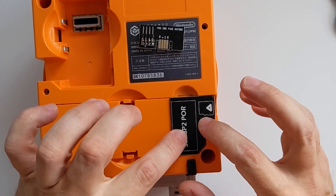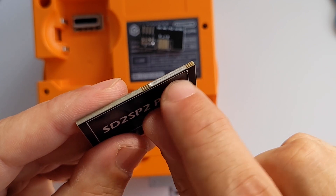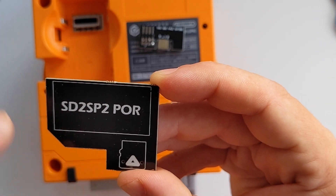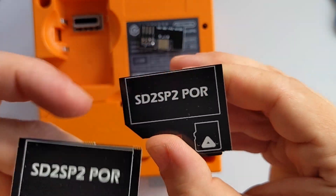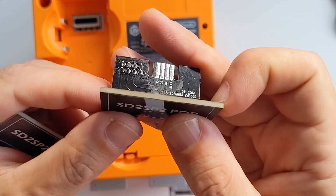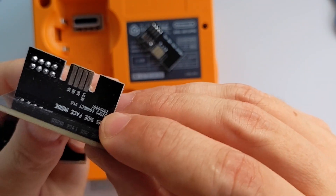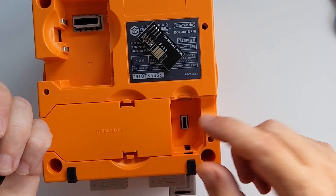The first modification is to get this part to fit neatly in place, and that is simply an issue with the PCB itself. You can see there are these zigzag edges where it's clearly been part of a large assembly — they've just been snapped apart. We need it to be just slightly smaller. I'll show you the one I've modified already: I've come closer to the line and removed that textured edge from where it was snapped off. So the first modification is to reshape that, and the second is to make it a little bit thicker by adding some solder to the surface of all of those pads.